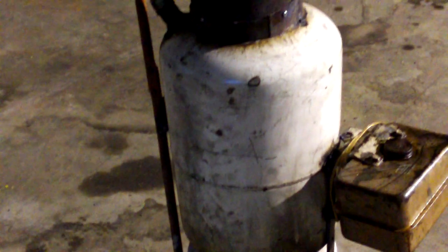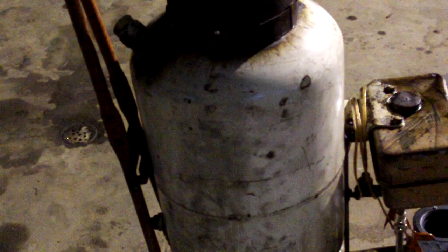In the top propane tank I have 15 pipes — seven-eighths inch outside diameter, half-inch inside diameter, 20 inches long. So there's probably about 25 feet of pipe in that tank. I would take this off to show you but I got screwed on there.